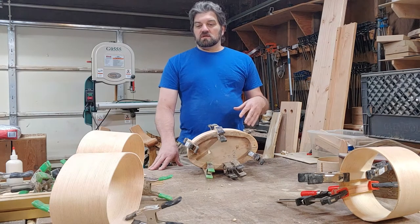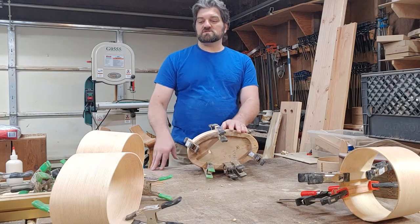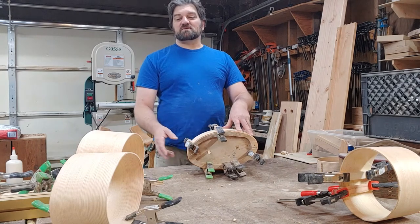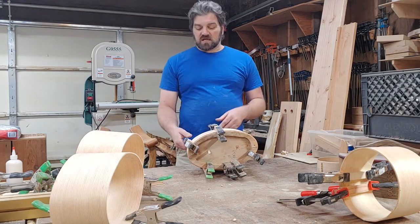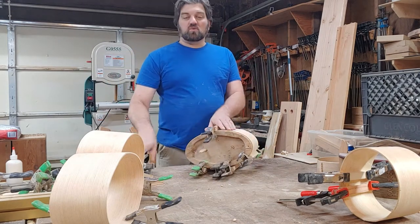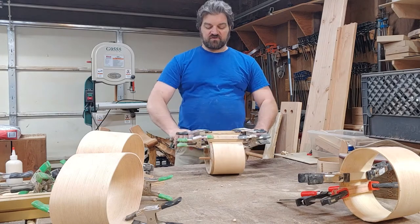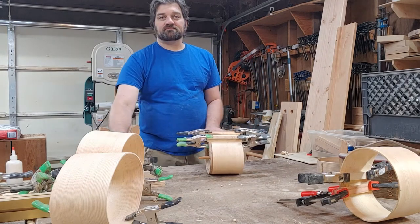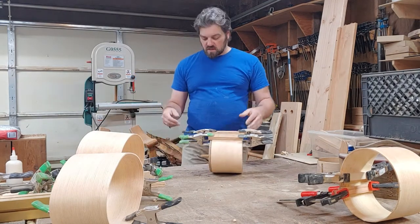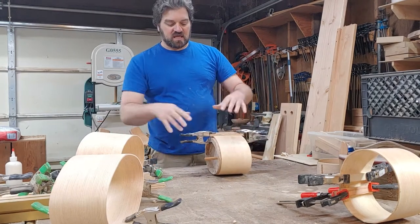But the contrast that I had — I've got two that I put on these oval forms and then the one that I bent by hand. It was pretty much the same size and the same form. And I discovered something really interesting. One of the long-term constant questions is whether they were glued or only stitched together. Every time I pulled them off the forms, I ran into a problem: there was a lot of springback. The inherent strength of the wood caused the overlap to open back up — it didn't take a really solid set.